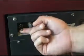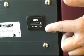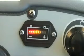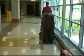The E-Ride 26 is equipped with resettable fuses and has an hour meter to allow the operator to know when to complete preventive maintenance cycles. Fault code indicators are installed on all E-Ride 26 platforms, which will identify where a fault code is located.